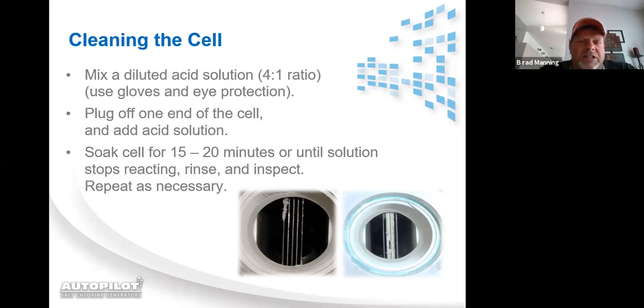And I highly suggest if you have questions on water chemistry that you join us for our water chemistry seminar that we have coming up, because there's a big, huge misconception that water is good because everything was within industry standards. When you run the saturation index, that's how you tell whether your water is balanced or not, whether it's alkaline, neutral, or scale forming. And basically, if you've got a pool that's got buildup, calcium deposits on the shell, it means that you're running high on the saturation index.